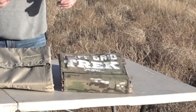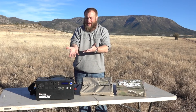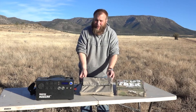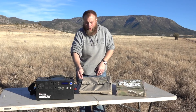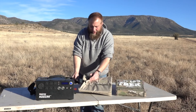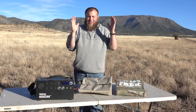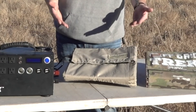Personally, I've been running two of the 215-watt panels together, using 430 watts or so to charge my devices. For those of you looking at a PowerFilm, it may have some shortcomings depending on what you're doing. This is great because it can get you up to whatever you need — there's a bunch of different connections, you can run it to the battery on your car, charge your laptops, your cell phones. Compared to some of the backpack models, like the small 20 or 40-watt type panels, this thing is going to do a lot more. But, again, it's a lot bigger.